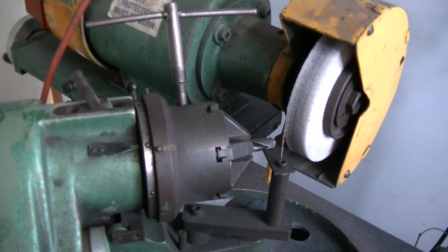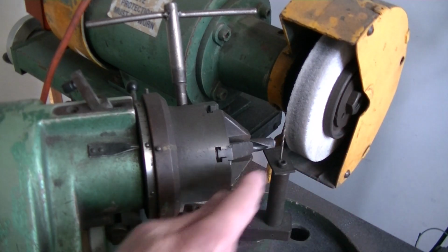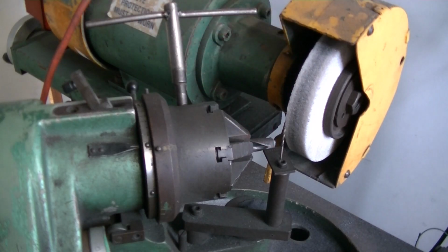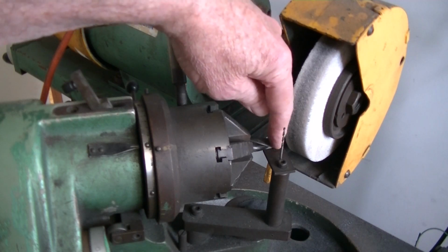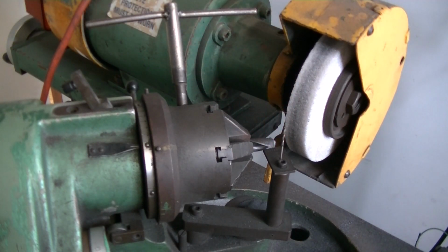Here's the Brearley drill grinder, and I've got the setting gauge pushed out to the drill lip, and the drill lip comes down to a little step in the side of the setting gauge. Now that shows you how short an extension you really need outside the front of the chuck. Hanging out by a large amount is not good, and it's graduated off in 1/16 of an inch, so you change the extension of the drill out to the larger sizes. Okay, off to another grinder.